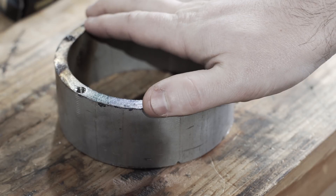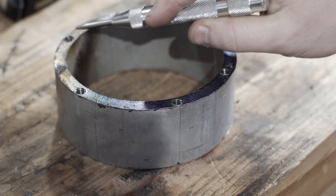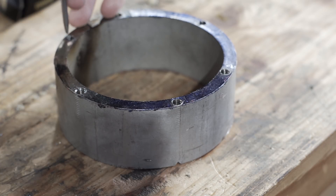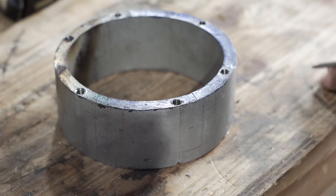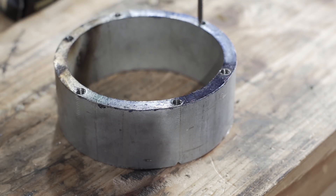I learned that stainless is hard to drill and hard to tap. My drill bit was certainly going too fast and I needed it going slower. The cheap Chinese drills didn't help at all. There's a broken tap over here that I need to drill out — I have a carbide no-flute drill coming to take care of that. The rest of the holes drilled and tapped alright, but it was very slow going.